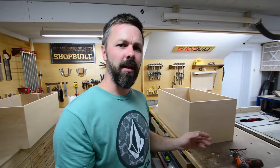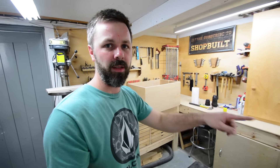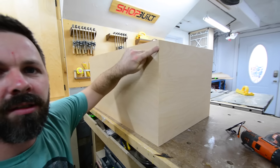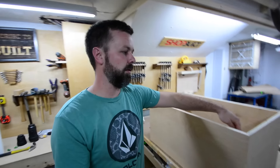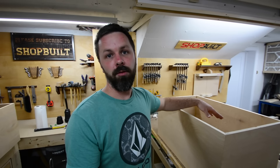I got them together and it actually wasn't as bad as I thought it was going to be. I definitely learned from the first cabinet before I did the second one, so this one is a little bit better. This is probably the biggest gap I got right here, but most of them are about as tight as this one over here — I'm actually really happy about that. I'll be able to fill it in, sand it, and you'll never know the difference. Now I need to put some blocks in here for strength, put the back panel on, and add the shelf.